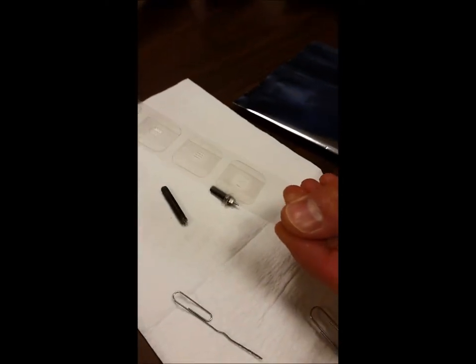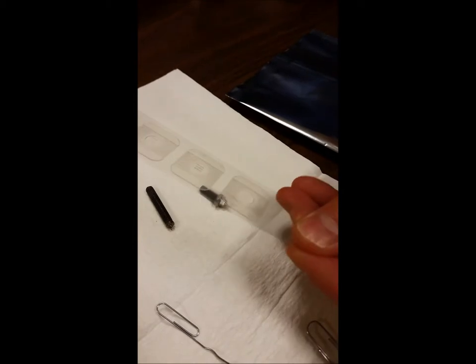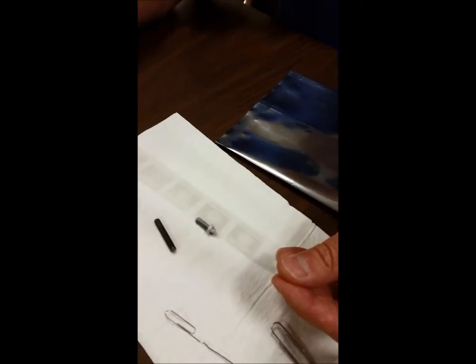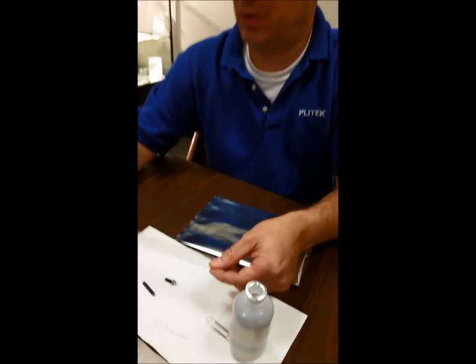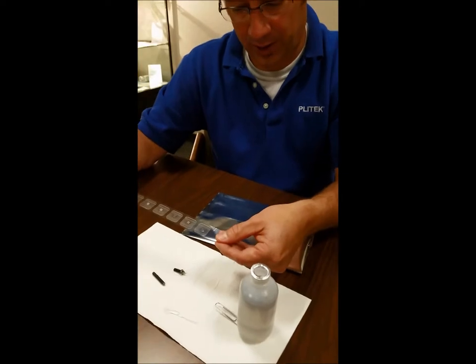It's going to be hard to see here with the camera, but when you do it you'll be able to see it with your eye. It's already been about 10 seconds and 25% of that dry strap is wetted out, so it's okay to apply at this point. We've got enough oil in there — I can see it moving, and it's going to create a reseal. Over the next minute or so, about 50% of that dry strap region is going to be wetted. When you put the proper amount of oil in, you're probably going to get somewhere around 75% of the dry strap wetted. Don't expect to see an entire wetted-out dry strap.